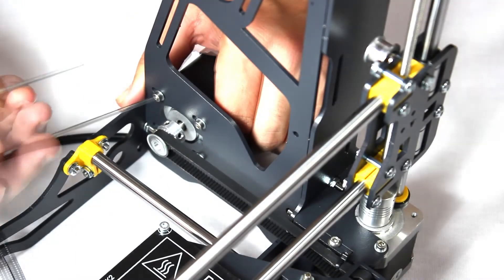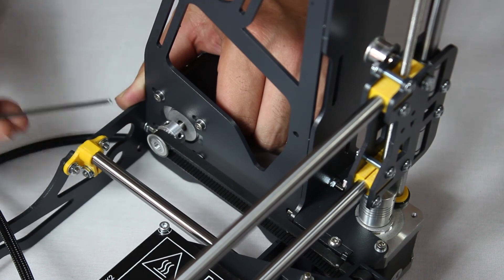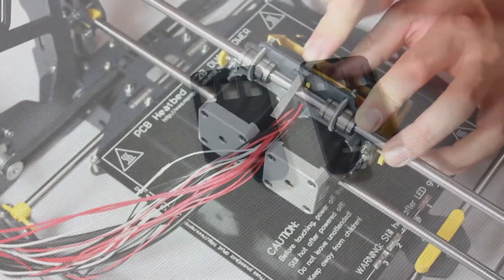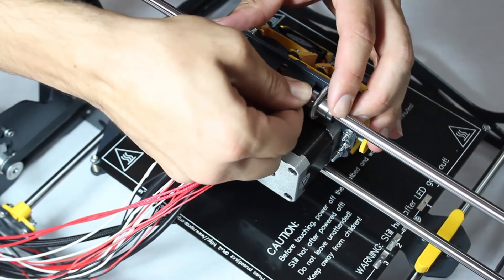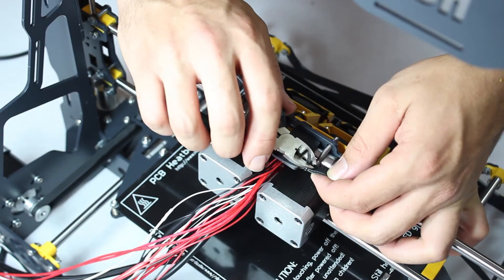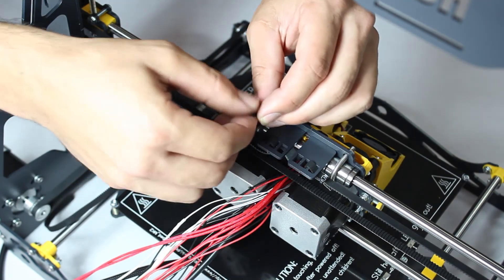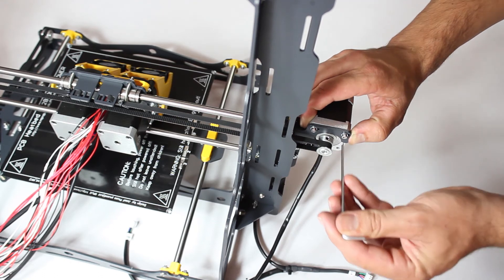Tension the Y belt by carefully pulling on the stepper motor and tightening the screws. If they've been tightened, loosen them first, stretch the belt and re-tighten. The belt must have some play in it and not be too stretched. Do exactly the same for the X axis drive belt. First, apply these small components on the X axis — you may need to file away spots of thick paint. Loop the belt tip, making sure the teeth face inwards, and fasten with a cable tie. Loop the belt around the pulleys and fasten the other end. Note the two small metal plates are held in place by the tension belt. To finish, stretch using the stepper motor, then tighten the motor screws.